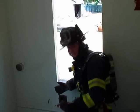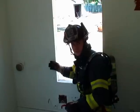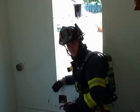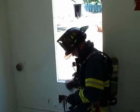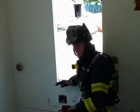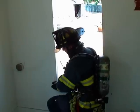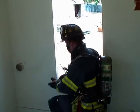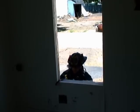Another option, if you have a last-ditch anchoring device like the Crosby hook — if you can't use the tool-in-the-wall technique because of the wall construction, or you don't have tools available — the Crosby hook is going to be your last option for getting out. You can place the Crosby in the corner of the window; depending on how your system is rigged, typically that's the left corner. Lay it as deep into the corner as you can and hold it in with a gloved hand. If you can punch it into the drywall a little bit, take advantage of that. You can use a leg to lock yourself in and control yourself before you exit. Once you've got the system loaded and tensioned, you can let go of the Crosby.